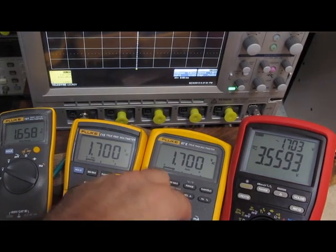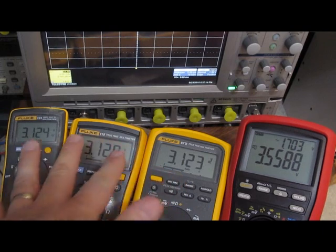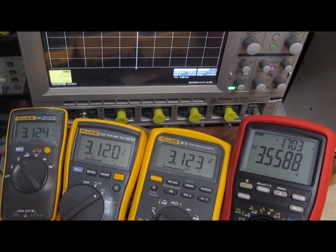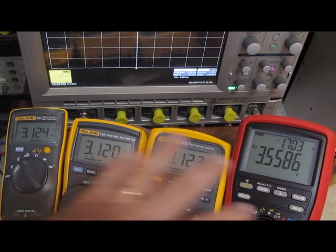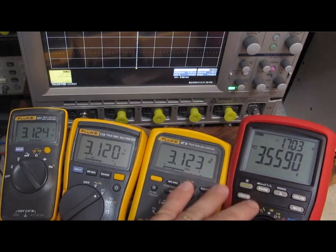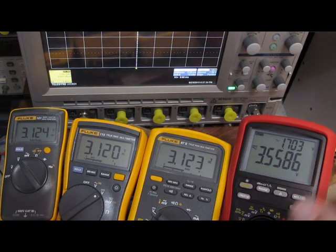Again, with these meters you can do this calculation. You just have to look at the DC component. You take this number, square it, take the other AC component, square it, and take the square root of the two added, and you'll come up with the same number here. It's just, again, I'm carrying around this computer. It doesn't make a whole lot of sense to make these calculations with a pocket calculator. If the meter can do it, why not?